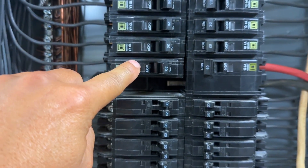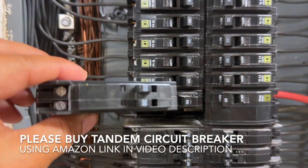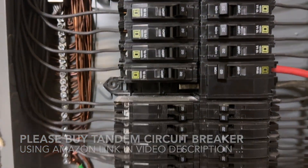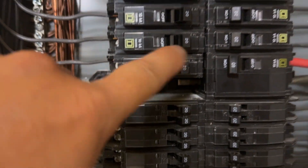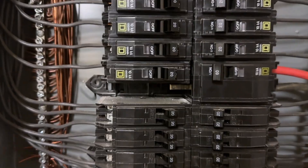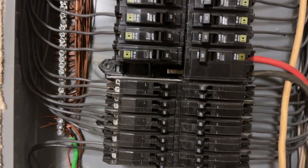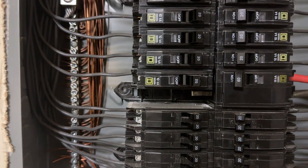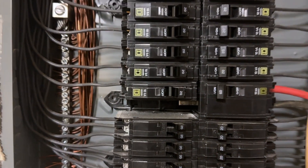So I have to combine these two circuit breakers into one. This is called a tandem circuit breaker. What I'm going to do is remove both of these cables, turn them off, install the tandem in place of this top one, and then put the cables back. That way I'm eliminating one circuit breaker and I'll have two spaces empty after I'm done.